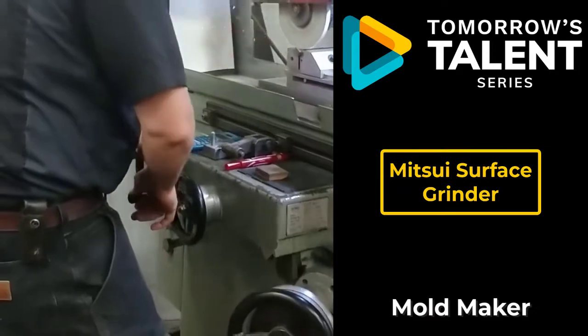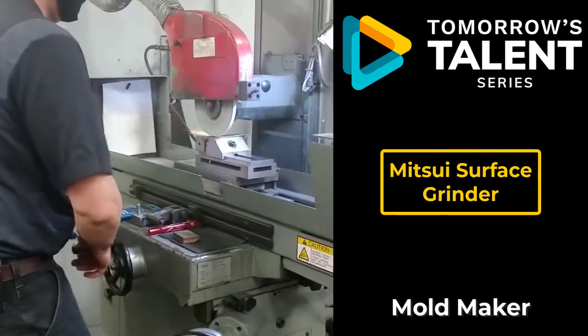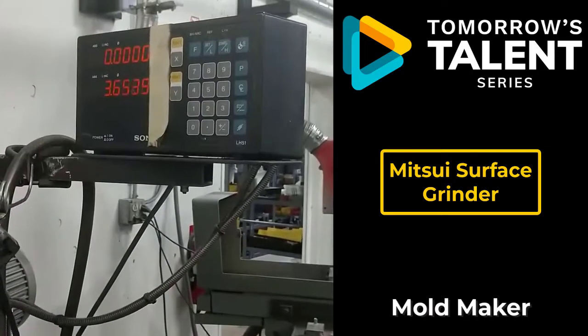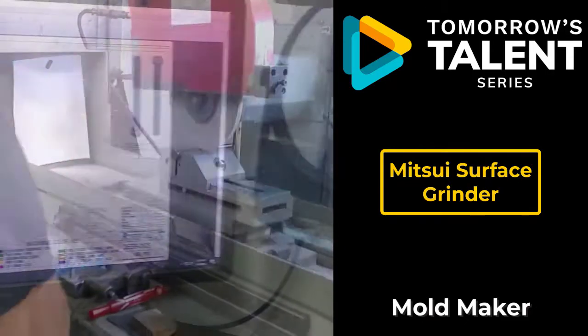Surface grinding is a very fine machining process. You can machine steel within 1/10 of a thousandth, 0.0001. That's a hair split 30 times. Surface grinders are the primary machine tool used in mold making.